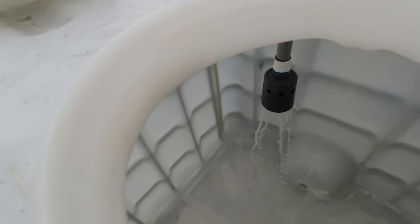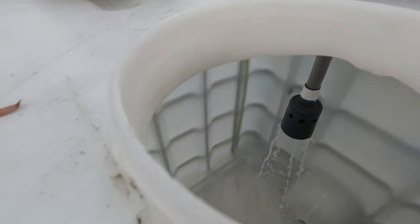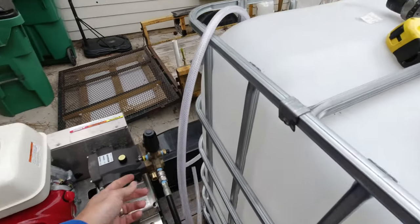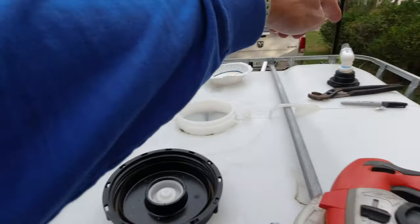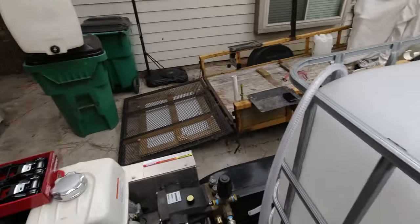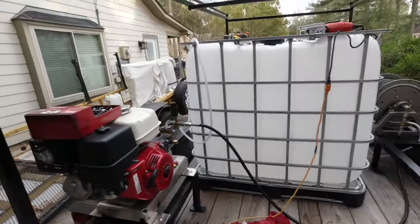As you can see, the Hudson valve looks to be working good so far — we don't know if it's going to stop. Anyway, we're going to put another bulkhead here, half inch, for our bypass line so we can bypass it back into the tank on the opposite side of the Hudson valve, because we don't want bubbles from this going to that side, creating air bubbles, which will result in the cavitation of the pump. So be cognizant of that when you're doing this.